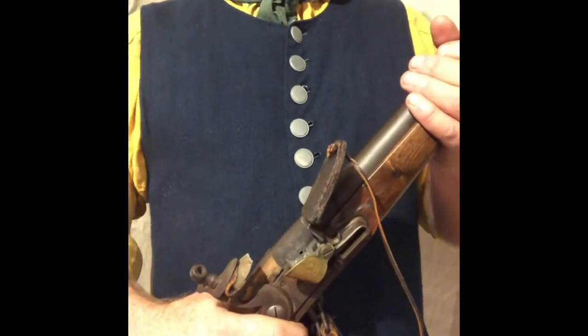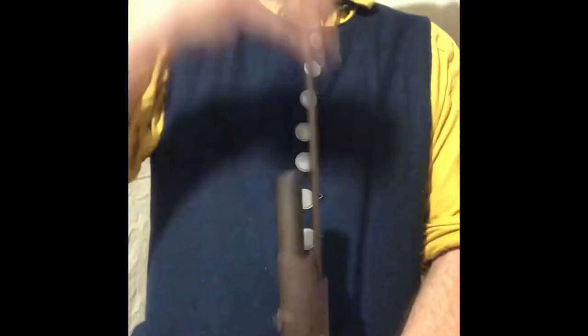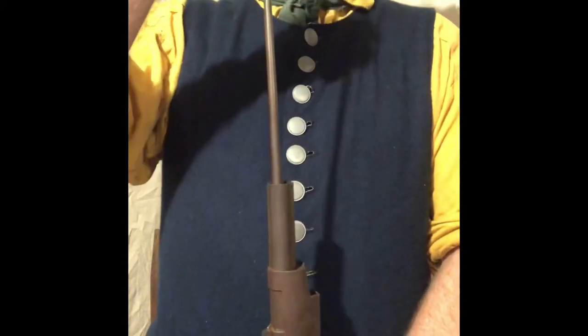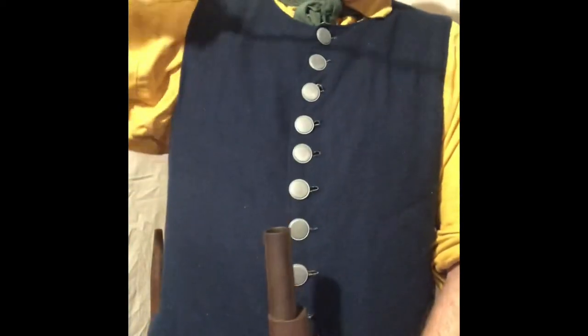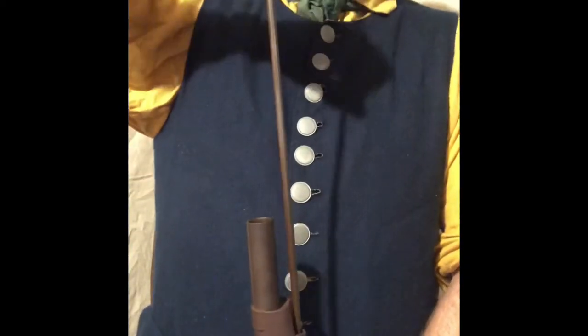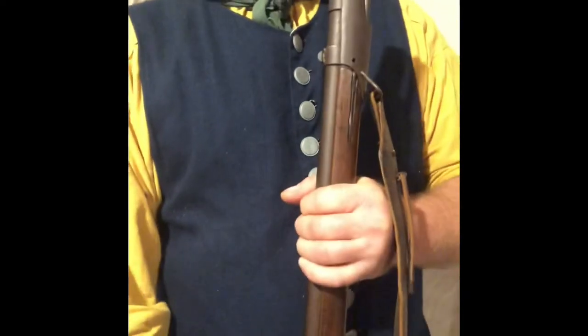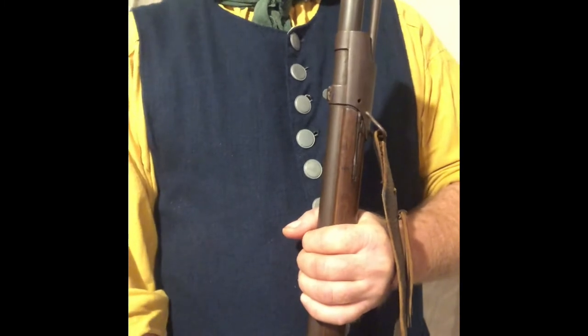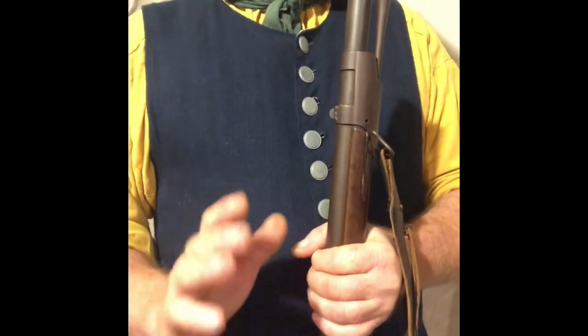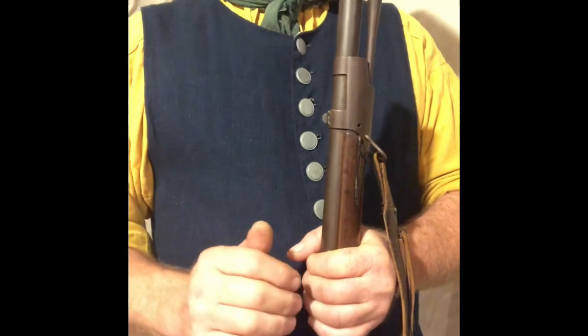The second thing they're going to ask is to ping your ramrod. You pull your ramrod, drop it down the bore, and you hear that ping. A wooden ramrod will bounce but it won't ping like that. What that tells you is whether there's a charge or something blocking that bore, or an old round in there. It's going to make a thud. That actually happened once on a gun I purchased — the guy handed it to me, I did a safety check, and it made a thud.